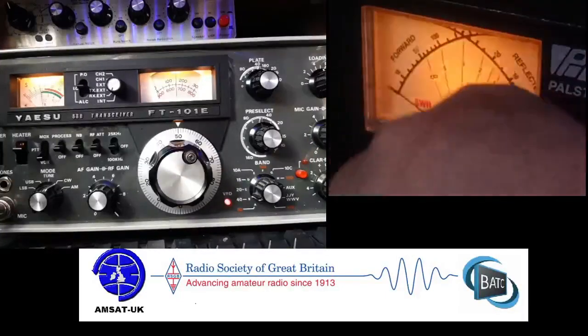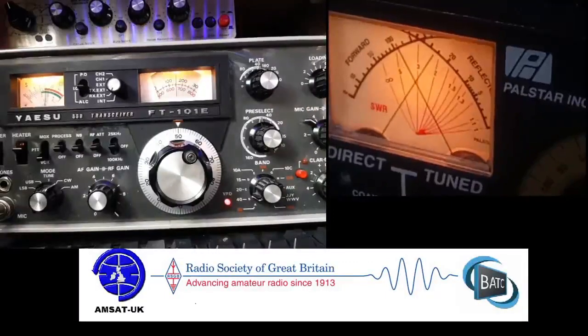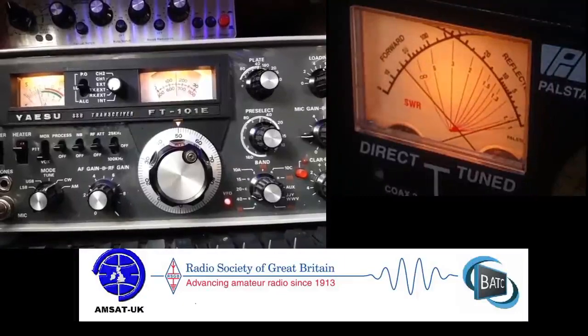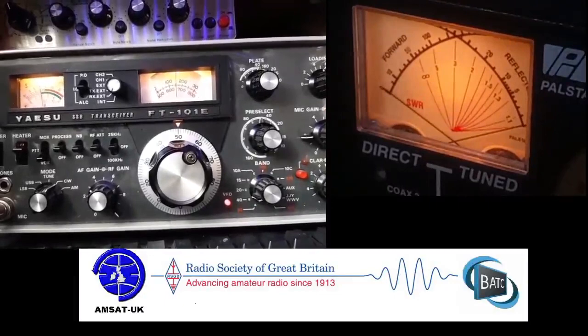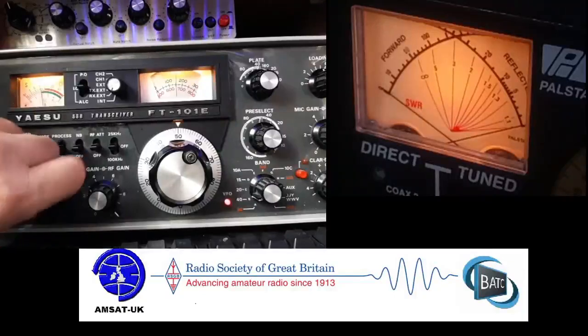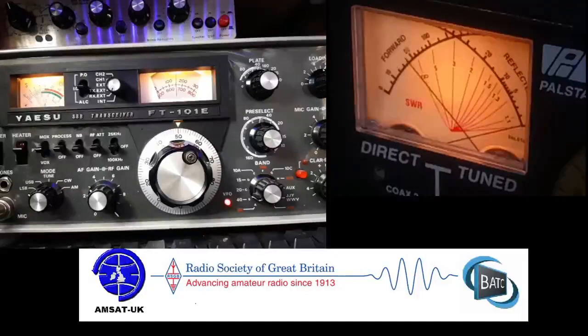Now comes the fun part — I love this bit. You've got to tune the antenna. Pull the power back a little bit and see where we are. Pull the power back a bit more. That's good enough. Actually, the radio's already tuned, so you can pop it back up to 9 because you haven't changed any of these things. CQ 40, CQ, CQ 40 — M0NMC calling CQ 40, standing by.